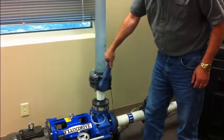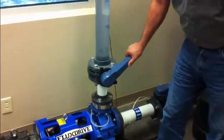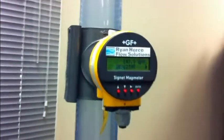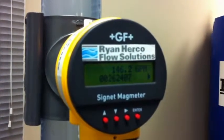If we partially shut the valve we obviously reduce the flow rate, which can save some energy. However, we're also artificially increasing the system head which wastes energy. As you can see from the flow and power meters, reducing flow by 35% down to about 147 gallons per minute only drops power consumption by about 0.3 kilowatts, or around 14%.